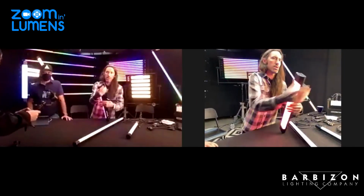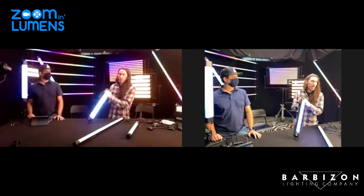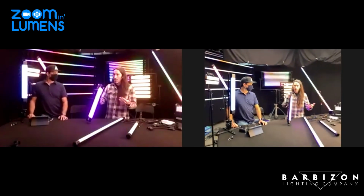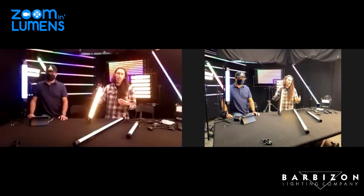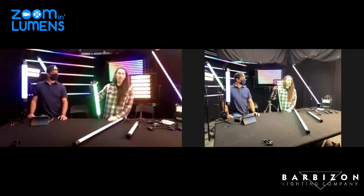So you all know what it's like to be on set and maybe the DP or the gaffer asks you to change the color of the light, but you've never used the light before. You don't know anything about the interface. So if he's telling you to take red to blue or tungsten to daylight or whatever like that, you may not be very familiar with the interface. So you can just kill that output. You can go in and change the parameter to whatever you want and then re-enable that output in that new setting that you have. So you're not blasting all of the set while you're trying to run through the menu, trying to figure out where you're at. And I think we like to call it our embarrassment control button, honestly, because hopefully it'll help keep people from getting embarrassed on set.